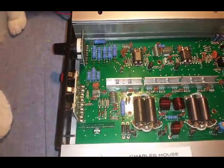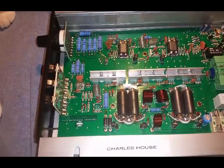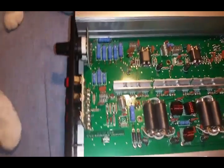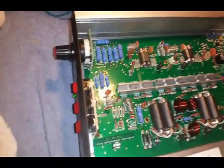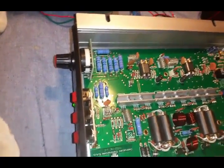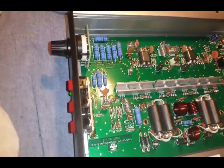It's just kind of an iffy thing. The instructions say do not drive more than about 8 watts PEP into it, so I'm not sure what you were driving it with, but it did take out the driver MOSFET. I would run a very low dead key with this thing — I think it recommends no more than 2 watts or so dead key. Just take a glance at the manual to confirm, as I looked at it a day or two ago.